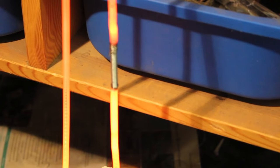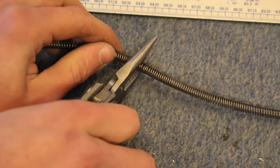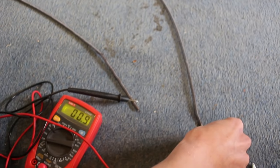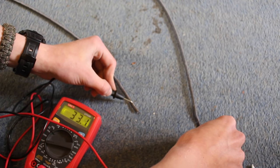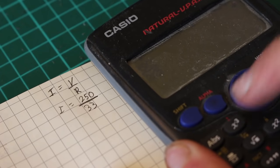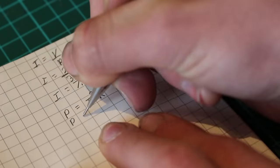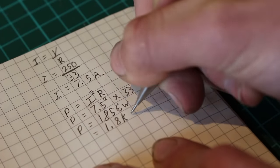The connection between the two wires was easily made by winding them onto an M6 threaded rod, cutting it off short, and crimping with pliers. I measured the resistance at around 33 ohms when cold — as the wire heats up the resistance increases, like a filament bulb. Using Ohm's law, the max current flow works out to 7.5 amps, well below the 13-amp circuit breakers. Using P = I²R, this is going to be around a 1.8 kilowatt heating element, which is really powerful.